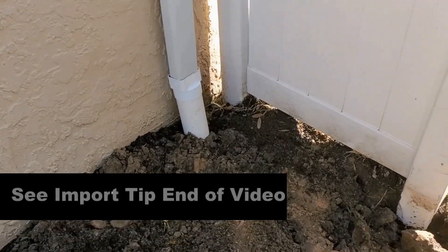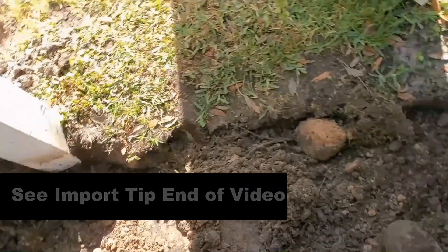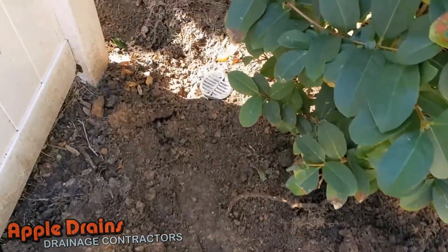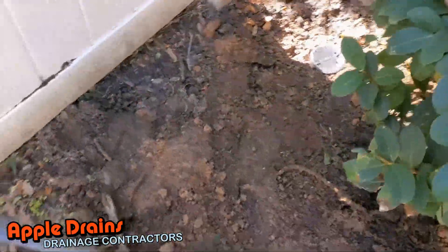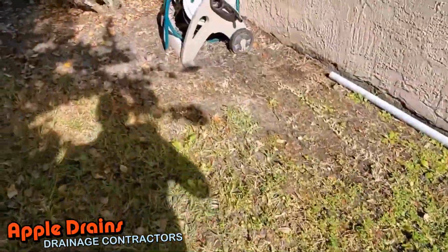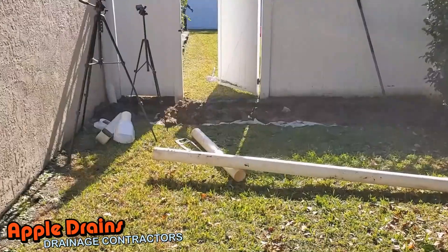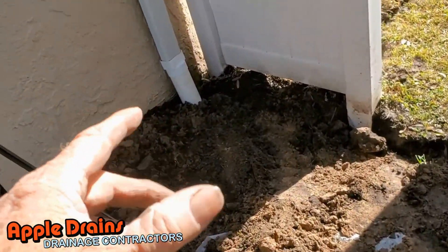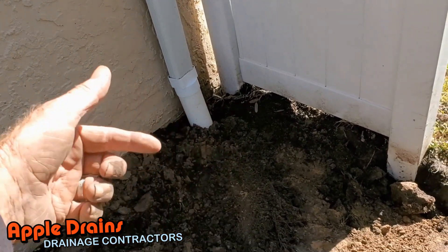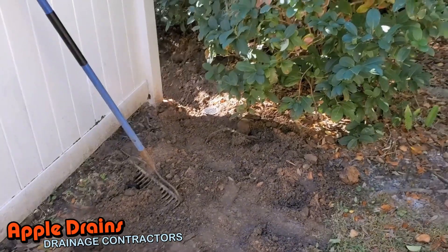You can see how that's shaped up: we've got a downspout adapter, a piece of extension going down to the 90, got it covered up. It comes out here to a little grate which we'll put a screw in. I just trenched a little bit around the side to help it drain away from this area because it's very flat here — in Florida we don't have a whole lot of fall for drainage away from the home. As that water comes down from the roof it'll have more than enough pressure. The head refers to the point where water discharges to where it starts to drain, so we've got about two feet of head before the water would back up.